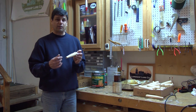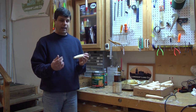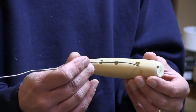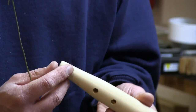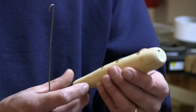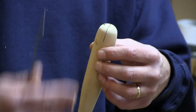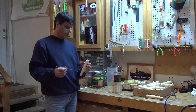All wood is going to absorb moisture through its end grain way before it does through the side grain. So the critical areas are going to be your through holes, your hook holes, your lip slot, and the front and back of the plug. Think of the wood as a bunch of straws held together — the moisture is going to want to come through the end there, and we're going to want to seal those off.